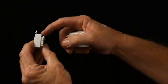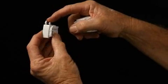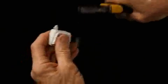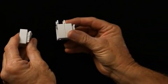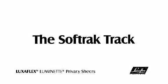The top of the fabric aligns with the top of the installation bracket, not the removable tab on the top of the bracket. The tab serves as a spacer to prevent the brackets from being mounted too close to the ceiling. This tab can be removed if the top of the fabric is finishing lower down a wall. A standard face mount bracket gives 13mm of clearance. Additional spacer blocks, up to a maximum of 4, can be used to give greater clearance if required.